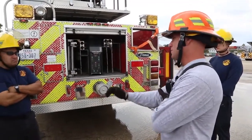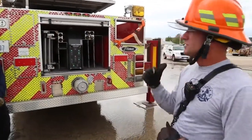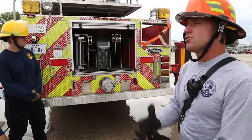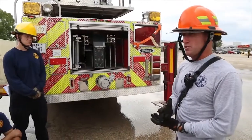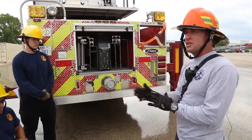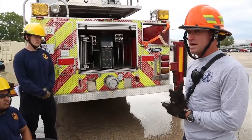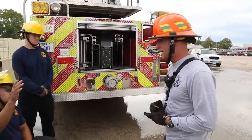Use according to manufacturer. All right, so now we talked about EPU usage and hitting your switch and running your EPU. Just be once again familiar with your run times. I will say this, the EPU, if you have a complete hydraulic failure, if it means you lost a hydraulic hose, the EPU will not help you. Does that make sense? If one of your pistons blows out a seal, or you lose a hydraulic hose, your EPU will not help you, okay? It's a motor driving the hydraulic system. It is not a separate hydraulic system. That's what I wanted to say. Any questions on that? Go ahead.